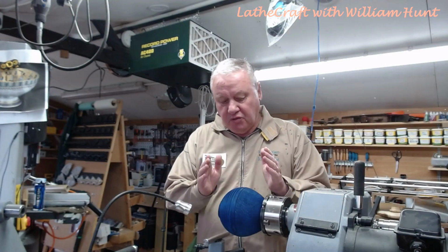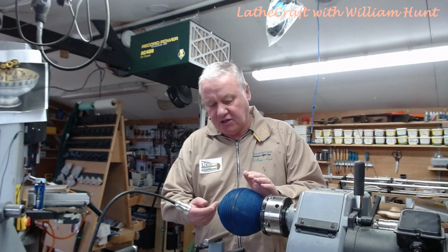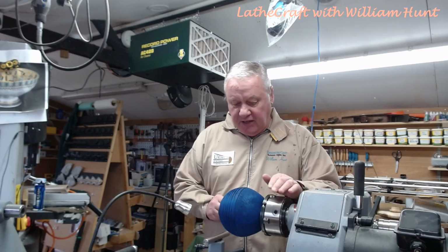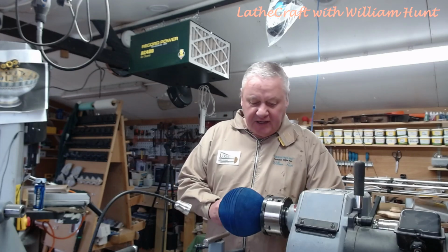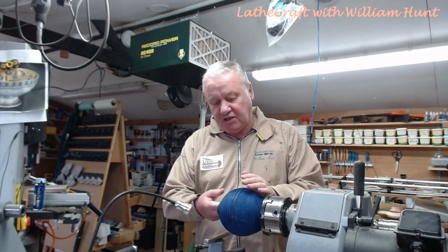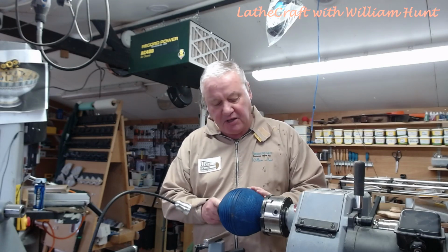Okay, so nice and dry. The moisture meter says between 6 and 8%, depends where you test it, which is lower than what I'd hoped for. It has warped a bit. It moved, of course. It was pretty inevitable, but that's not an issue because the outside is more or less complete. So what I'm going to do now is to just tidy up the inside, finish off that, decide what I'm going to do with the rim, probably try and put another bead on it and finish it off.